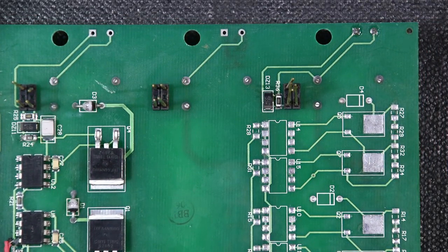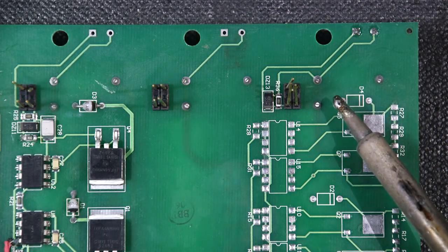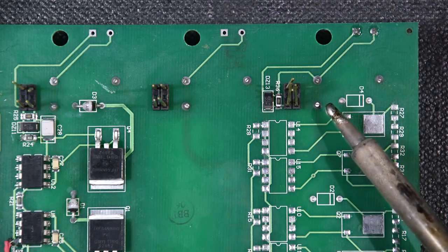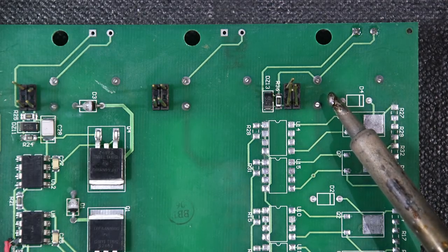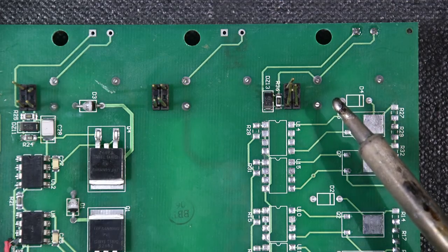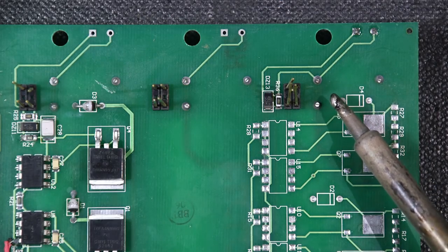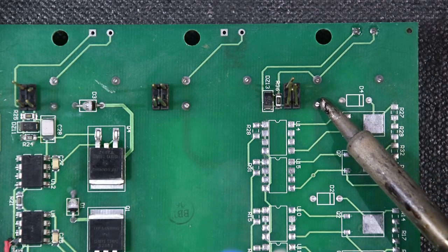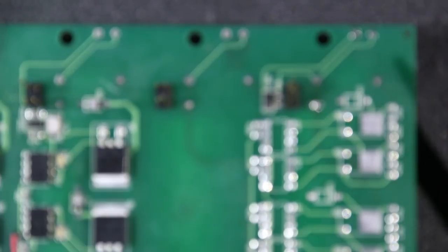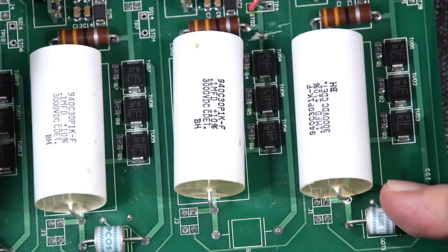You also want to make sure there's enough solder on there so it will vacuum properly. If there isn't enough, you want to add some solder to desolder — a little bit of a technique there. So I'll get my iron ready and clean the tip off with just a bit of solder. It's always good to add a bit of solder because it makes thermal connection a little bit quicker. One thing to keep in mind is that you're going to be dealing with dwell time — that's the amount of time the tip is on the circuit board or plated through hole. You want to keep that as short as possible, but yet heat the joint and allow the heat to melt the solder on both sides of the board since this is a double-sided circuit board. You can see it's just about melted there and it's loose — it looks like it didn't do too bad of a job.